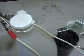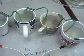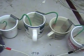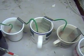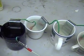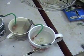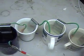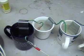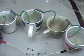It's putting out between 3.9 and 4.1 volts across five coffee cups, so I'm thinking anywhere from 15 to 16 cups would give you 12 volts. You increase the amperage by increasing the surface area on your two plates, and increase the voltage by the number of cells. So in reality, if you got in a bind and didn't have any power, you could definitely power your radio, stereo, or whatever runs on DC with something like this. Make a few comments, let me know what you think!